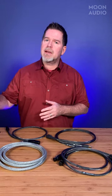So yes, you can use digital cables in place of analog cables — they may not be optimized, but they can sound good. Analog cables, however, do not use in digital applications. They just aren't set up correctly; you're going to get things like jitter propagation and your signal won't sound as good. Next time I'm going to talk about how to convert RCA coax to XLR AES-EBU — for example, if you've got a CD player with only RCA and a DAC with only XLR. We'll give you some problem-solving tips on how to resolve that issue. See you next week.